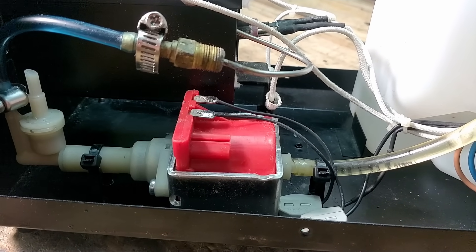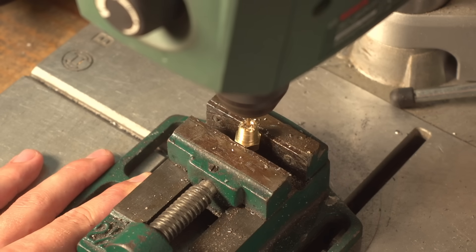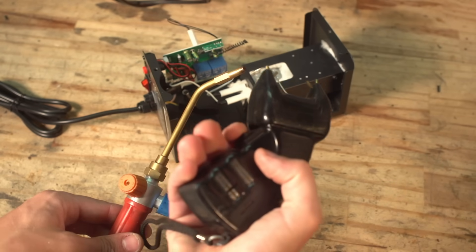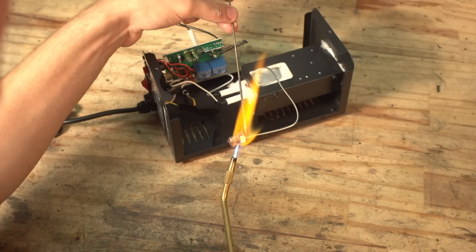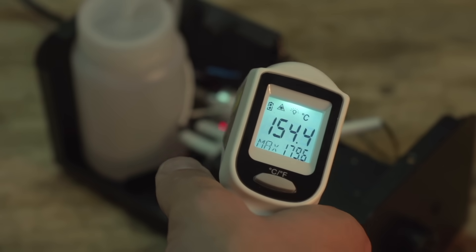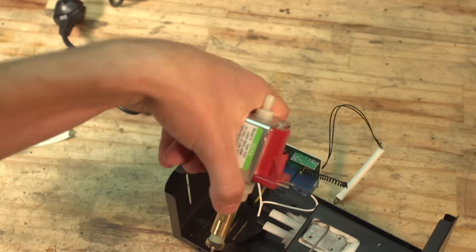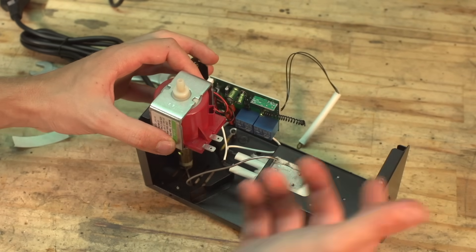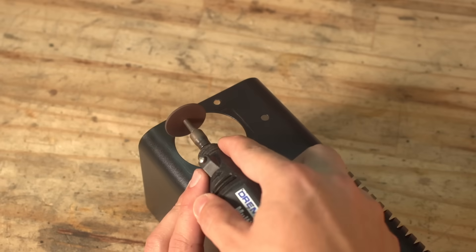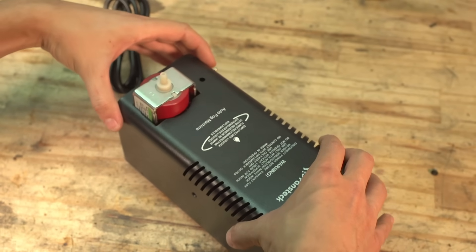I also replaced the pump inside my old 700 watt machine from my other video — because the casing is a lot bigger, the pump fits inside without any issues. The tricky part is figuring out how to hook up the 2mm copper tubing to the pump. I drilled a small hole in a 1/8th brass fitting, then after applying solder flux, I carefully brazed the fitting onto the tube. If you don't have a brazing torch, you could try binding the fitting with epoxy resin, but I wouldn't really recommend it as epoxy goes soft when heated and the entire machine gets pretty hot when operating. Then I screwed in the pump using Teflon tape to prevent any leaks, carefully positioned the pump vertically where the container used to be, and hooked up the pump to the controller board, soldering the connections to the same pads the old pump used — polarity doesn't matter as this is AC. Using a Dremel, I cut out the shape of the pump so it would stick out of the casing without any issues. And we're done!